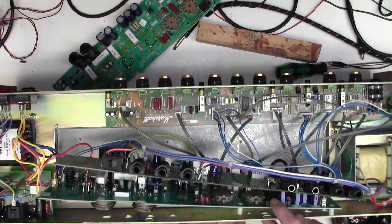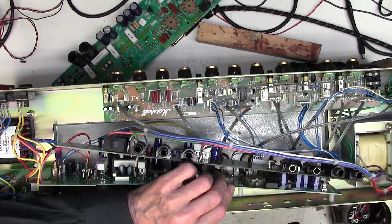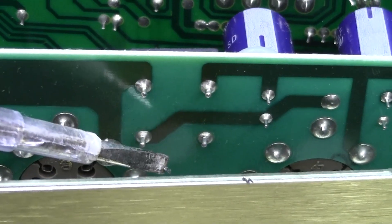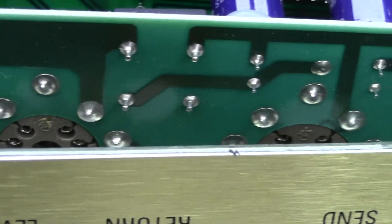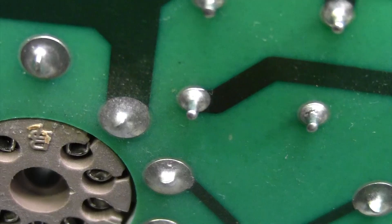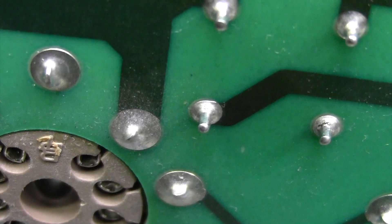I'm hoping to be able to have a quick look under here where that bridge rectifier is. Oh yes, I can see quite well there. I'm just going to get my eyeglass on there and see - there's the bridge rectifier. I'm going to have a little look at the joints to see what's going on. Aha - there's a perfect dry joint on that bridge rectifier. Let's have a quick look. The dry joint is on this pin here. I think you can just about see that - a perfect dry joint on that bottom right hand pin.